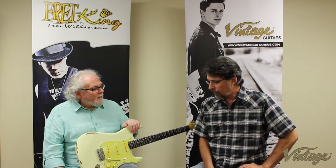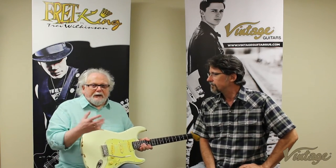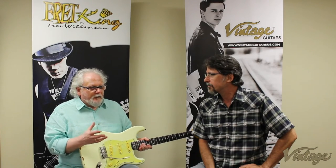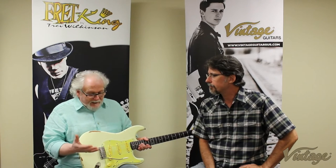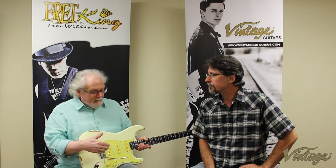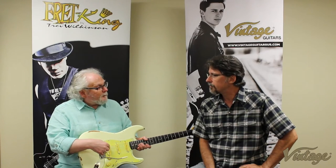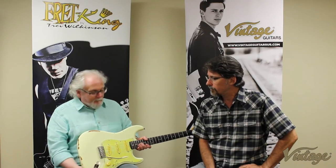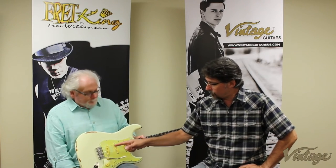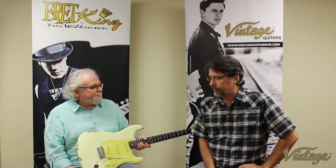And there's a little surprise down in that lower tone knob. He decided that he loved the sound of the guitar the way it was, but there were sometimes he just wanted to fatten up the sound a little bit and give it a little bit more power. So what he did to his own guitar, and what we've done to this, is we've put an extra coil in here which boosts the output of these two pickups. So it really will take them over the top, fattening up the sound simply by pressing the button switch. Does it boost the middle and the bridge or the neck? It doesn't boost the middle, it boosts the bridge and the neck. Gotcha.